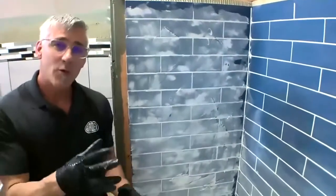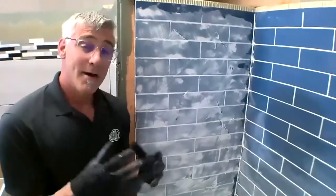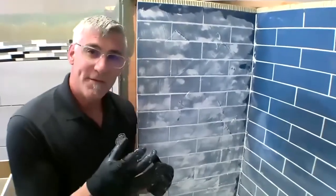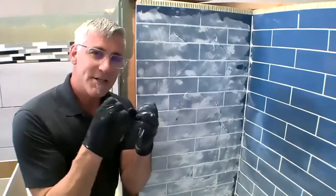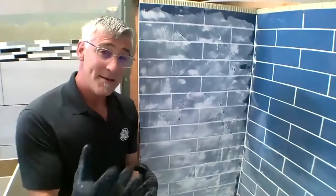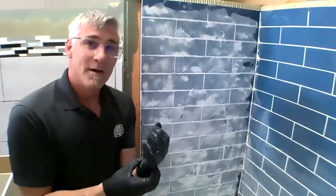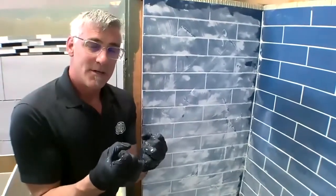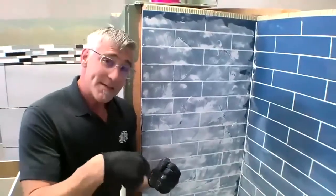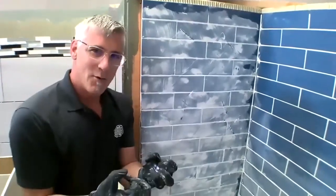Right, so how that works is ARDEX FL grout and FGC grout, while they are a 118.7, that high performance standard for grout, the FL being fluid flows in there and actually creates a denser cement matrix. Now, calcium alumina cement that's in it, what that does is it actually retains that water, locking it into the matrix of the grout, creating a denser, stronger, harder grout. And remember when I mixed it up, it was hydrophobic. The water didn't immediately soak into the grout.